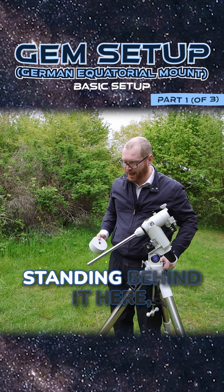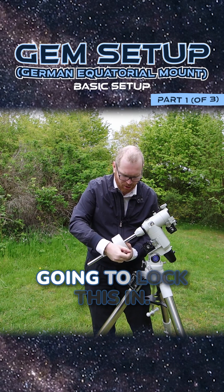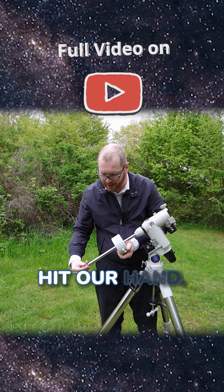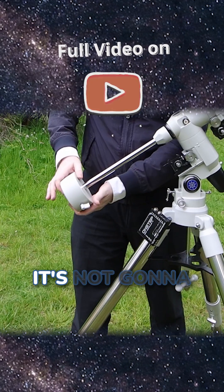I also recommend standing behind it, slide this up, and then with the screw that you saw on here, we're going to lock this in. Now we can put the stop screw back in while keeping a hand on the counterweight so that it doesn't slide down and hit our hand. When that's screwed in, we're secure. Should this, for some reason, slip, it's not going to fall off.